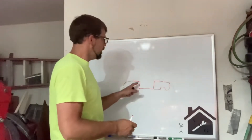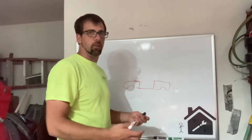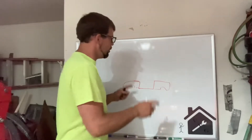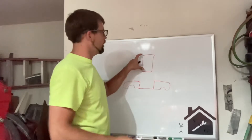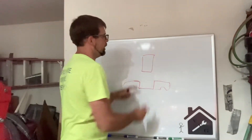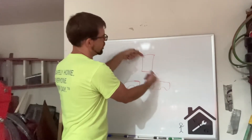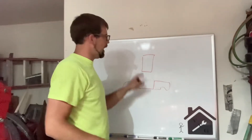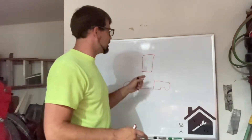It's really not going to flex a whole lot. The other thing I'm going to keep an eye on is the door jam gaps. Of course, this car is already 50 years old and it's already settled some anyway. The dimension I'm more concerned with — if you're looking straight down at the floor, it forms a rectangle: the firewall, rear seat, driver's side rocker panel, passenger side rocker panel. What I don't want is the distance between the corners to get larger or smaller — essentially, the car shifting like this.